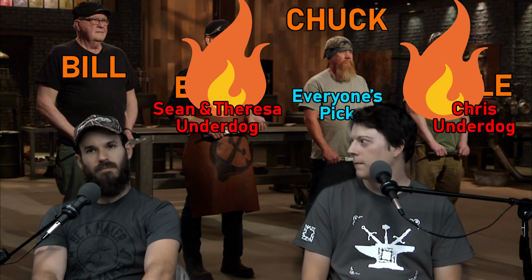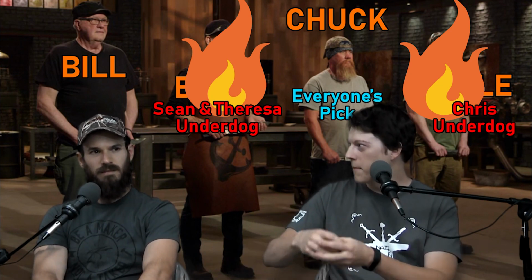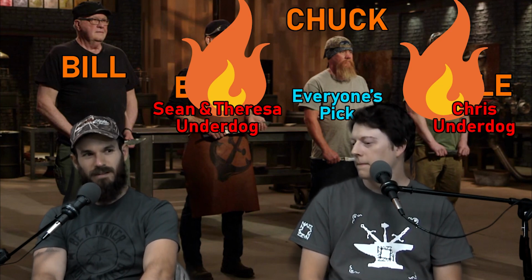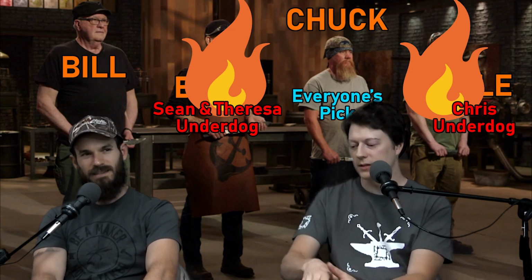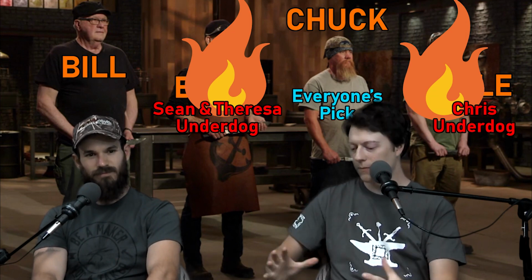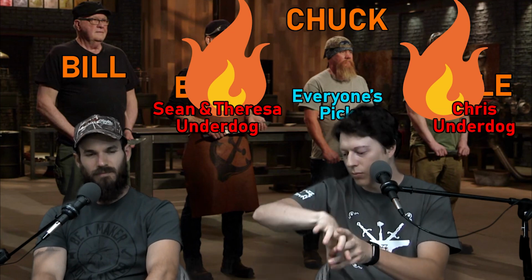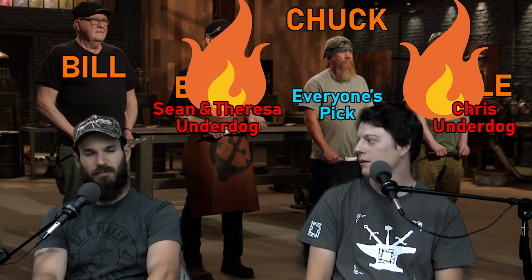Wait, is that how it works? Yeah, because you pour it and it eats that foam, it melts through it because it's molten, and that's why you use foam. Oh, really? Okay, I guess I didn't catch that part. They weren't making a void out of it, because then you wouldn't be able to. What you do is you carve the piece of foam, put it in the sand, pack the sand, and you have a top part. It's supposed to have a little hole or way for the molten metal to get into the foam, and it just burns through it, and that is how you cast your piece.